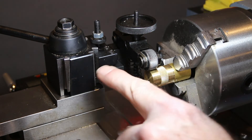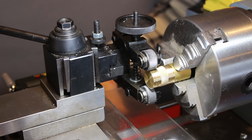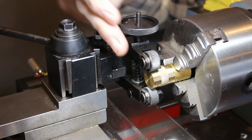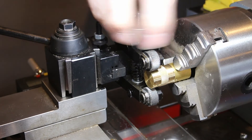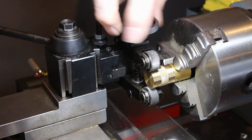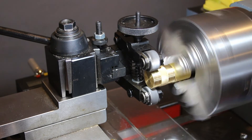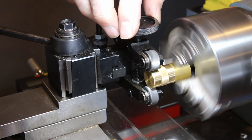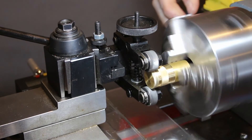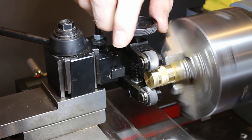This is the knurling tool, which I have attached into a quick change adapter. The way this works is you get it into position, center it up over the material you want to turn. It's loose right now — you can see it can move a little bit. When you turn this knob, they both grip down onto the material. Get the machine running really slowly, make sure there's plenty of oil, and then just start bearing down with this knob until you get a nice knurl. It's usually a good idea to stop and check to see if it's knurling well — which it is, it's creating some nice diamonds. So I'll continue and just knurl a little bit more.